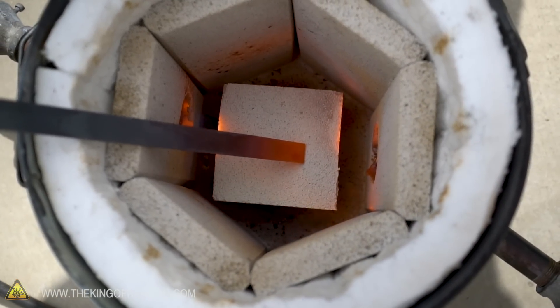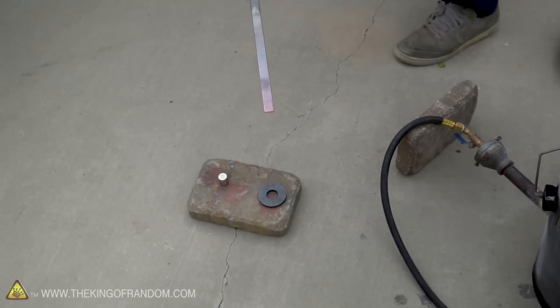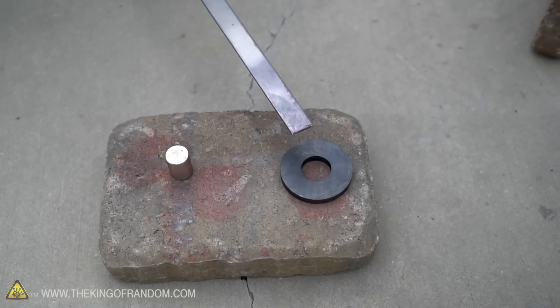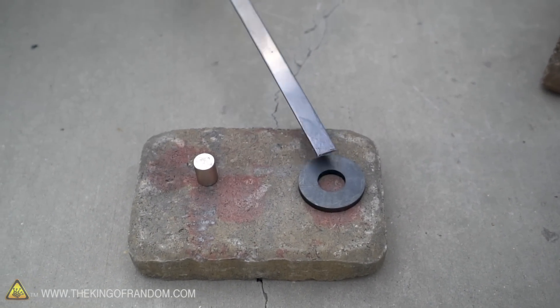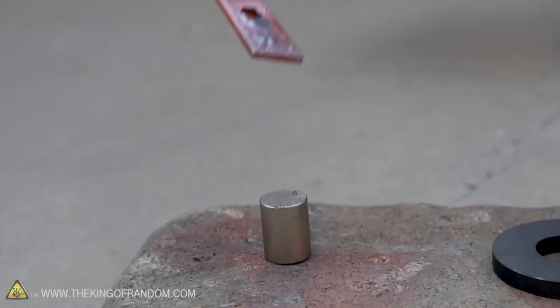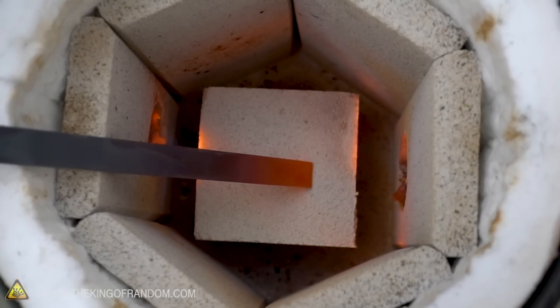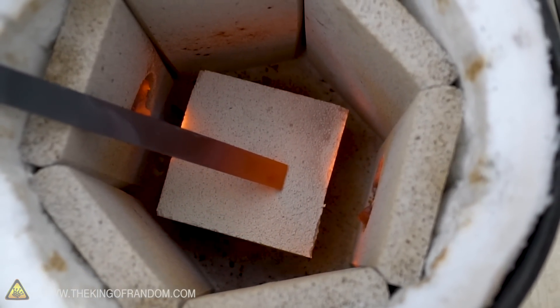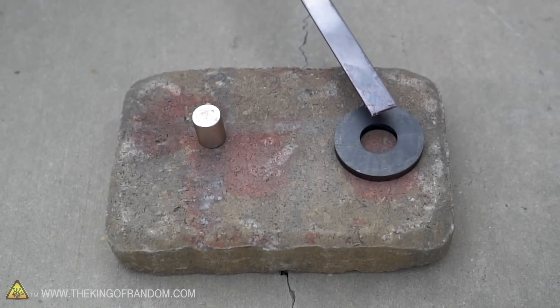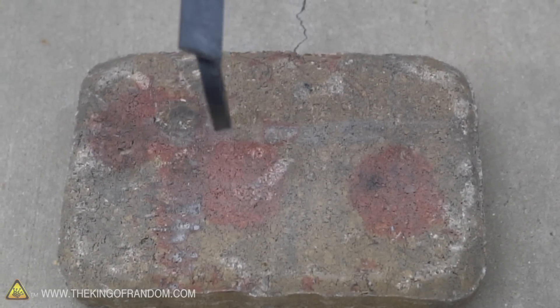First up, we're gonna fire up our furnace and put our bar of steel inside so one end gets super glowing hot. One end of our steel bar is now glowing orange hot — this furnace gets up to about 2,000 degrees. In theory, at about 1,400 degrees it stops being magnetic. Our steel was glowing orange hot and at that point it was no longer attracted to either of our magnets. The neodymium magnet is very powerful but had no attraction to the steel. At approximately 1,400 degrees Fahrenheit, mild carbon steel is supposed to lose all of its magnetism, and this bar was well above that temperature. The steel also has to cool down to about 500 degrees before it regains that attraction to magnetism after being heated up that high.